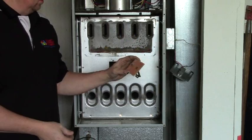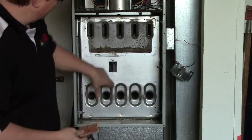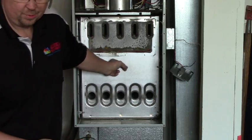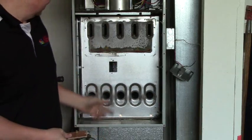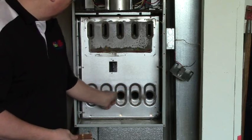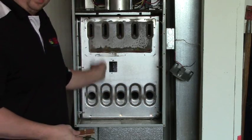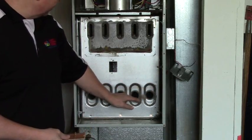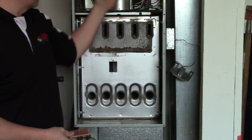Behind the limit switch is where we found the cracks in the heat exchanger — just inside here. There's two of these here. We'll see how many other cells make up the heat exchanger: one, two, three, four, five cells that make up the heat exchanger. Gas gets to go in here, comes out here, and exhausts off.